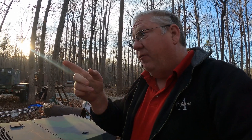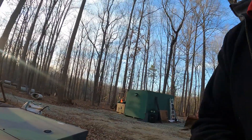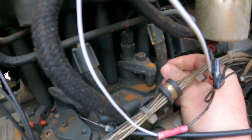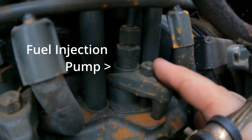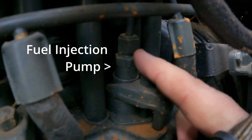I've got the side of the generator open. Let's take a look at the side of the engine. I think it's going to be easier for us to really see what's going on on a parts unit over here that I have the lid off of. Here we have a parts machine - we've got a little bit of light so you can see a little better. You can see that we have a nut right here, which is what holds the injector down, and up here we have the hard line, so we need to loosen this so that the injector will turn.